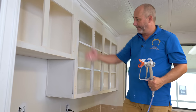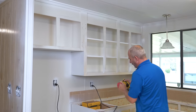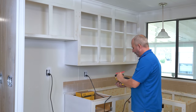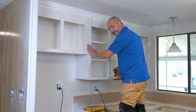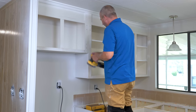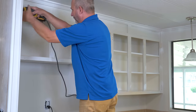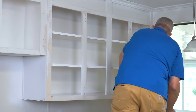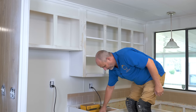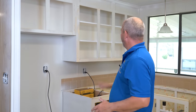All I've got to do is switch over to the 220 grit and do a little finer sand to make the transition from one paint to the next a little smoother — get rid of the 60, turn on the 220. Give it another quick scuff because when you run your hand over it you can feel the texture and you don't want texture when you're painting. You'd be amazed the difference going from a 60 to a 220 makes when you're touching it.